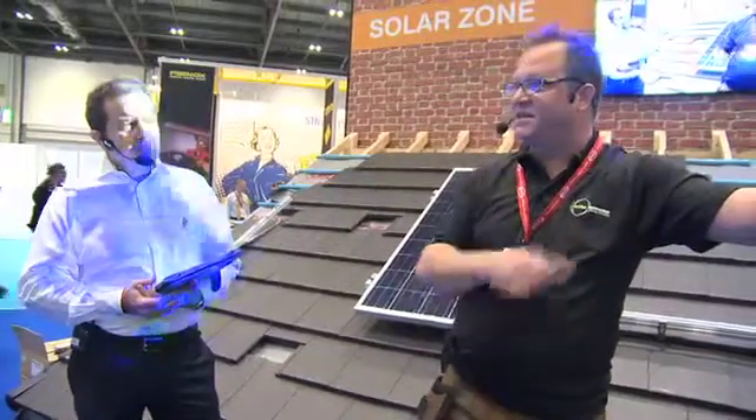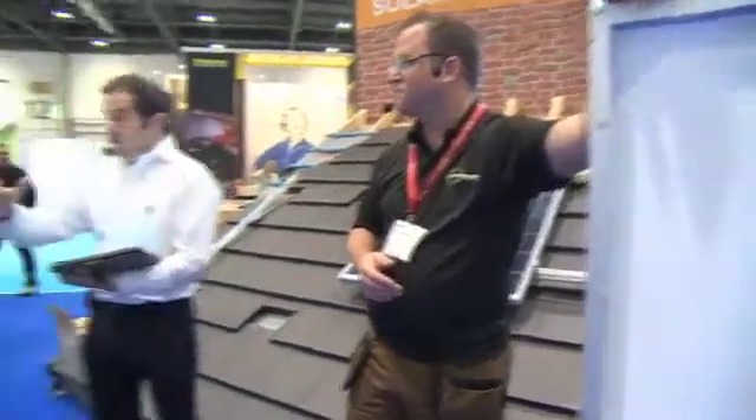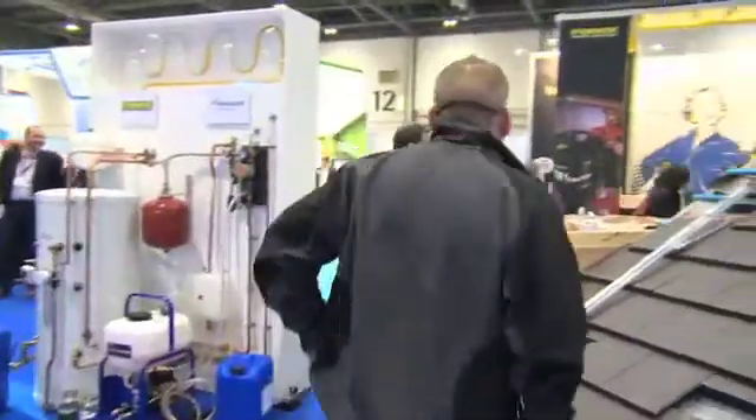On inverter sizing, the whole electrical design of the system is part of the upfront process that your MCS accredited installer will go through. With the SolarEdge system it's very flexible — because we have the optimizers, we're able to extend and have longer strings than we could with a standard inverter. A string is a series of panels connected together in series; you can have multiple strings in a system. With SolarEdge, one panel could be at fault but the rest will still work optimized — these mini optimizers make a massive difference.